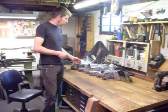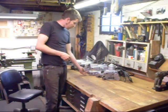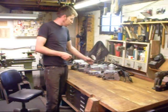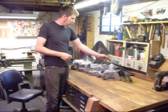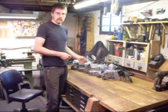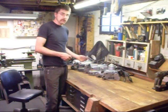Now, depending on the model, you may need to remove a screw under here, and you'll want to disassemble your switch because your switch wire is going to be attached to your field. But all of their sanders come apart in this way. The B5 differs chiefly in not having a chain drive between the armature and the worm gear, so it comes off from the top, much like a router.